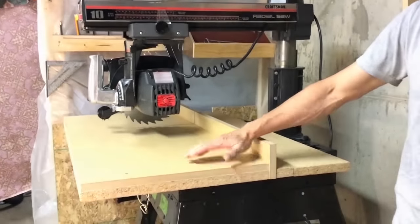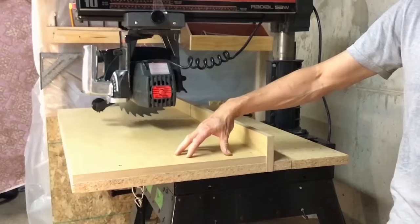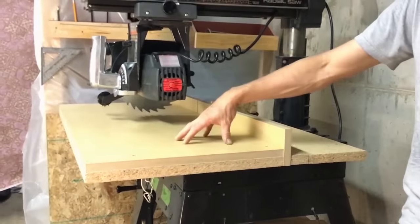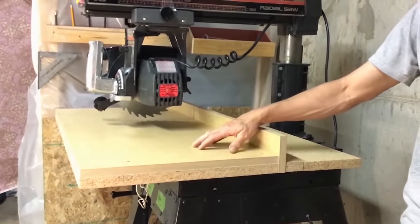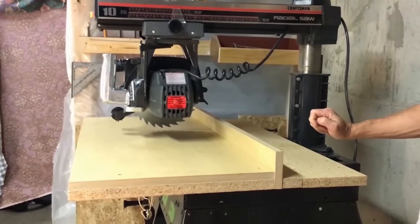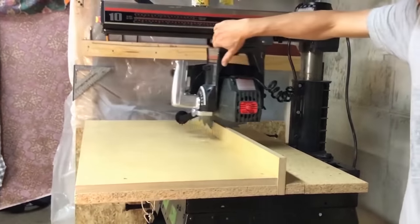This saw blade is set to cut 1/32nd of an inch into the front table, but when it's behind the fence, it has at least three-quarters of an inch of clearance. We don't want anything back there for that saw to grab onto. The height difference between the rear table and the front table is a result of the front table having a table protector attached to it — so when you cut, you're cutting into the protector, not the regular table. It also creates a safety zone where the back table is lower, not giving the saw anything to grab when parked there.